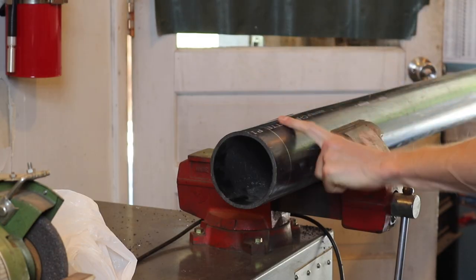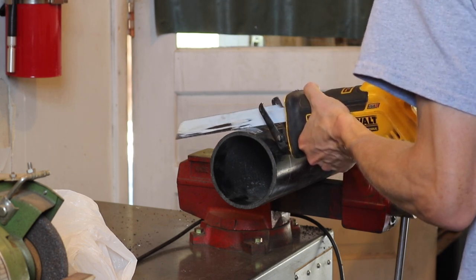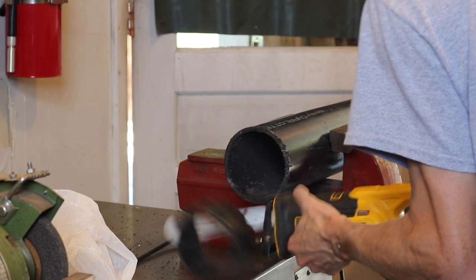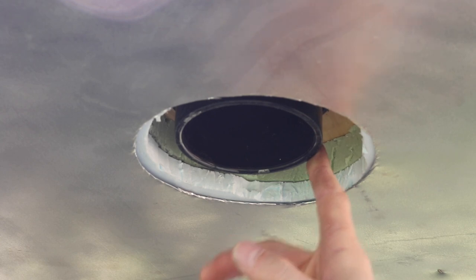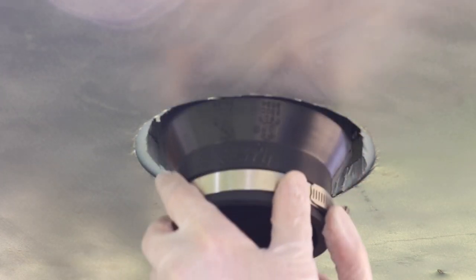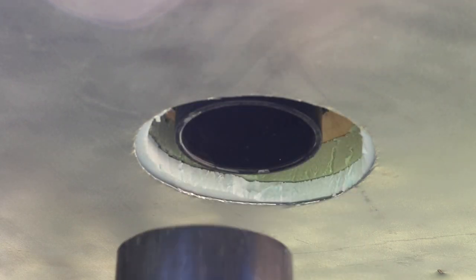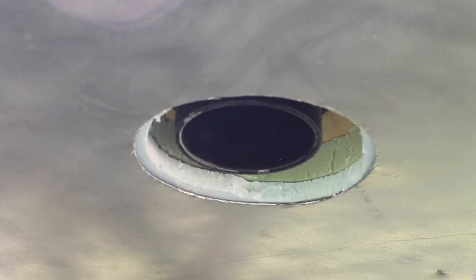I've got a five-foot section of four-inch ABS pipe. We're going to take a sawzall with a steel blade and cut it where I've marked. This is the closet flange — usually for household toilets — which is solvent welded to the bottom of the black tank and sticking out of the floor through the belly pan. To get to the right plumbing and have a flexible joint, I want to use a four-by-three Fernco coupling, but it's a little loose on the four-inch ABS.